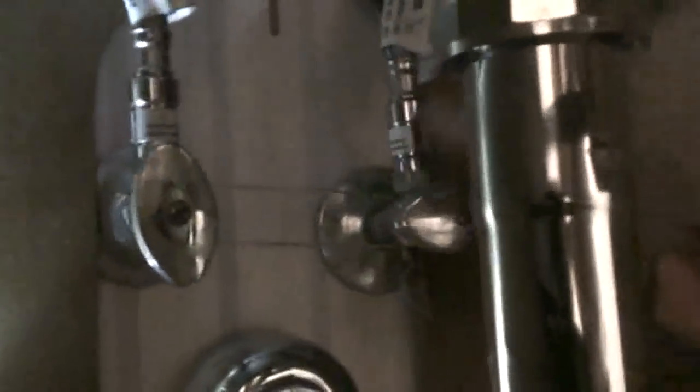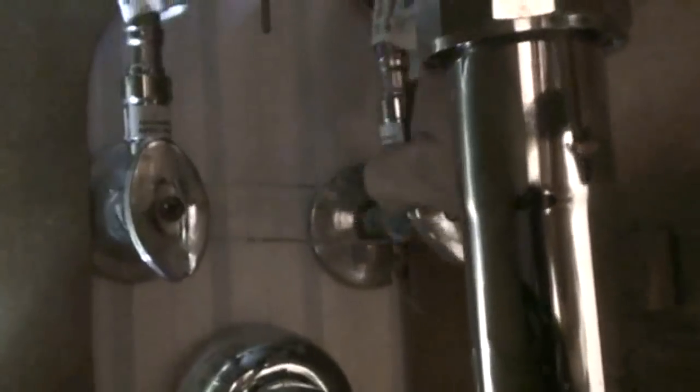There's a wire here holding these two valves together. The reason is that there are drawers in this vanity with cutouts to go around these pipes, and the clearance is very close. I remember from last week that these valves have to be perfectly straight up and down or the drawer won't close. Right now that one's horizontal, so the drawer won't close — I have to make them perfectly vertical. Since I've messed with them, I'm doing the finger trick behind the handle again to check for water. There's a little water in the bottom of the cabinet from us working, so I'm wiping everything down — a nice clean job, cleaning the chrome trap, checking behind both handles for any sign of leakage. We're done under the sink.